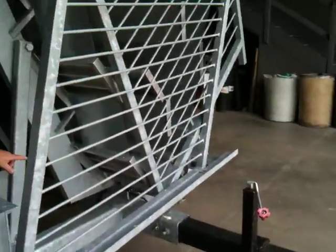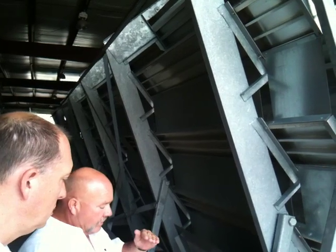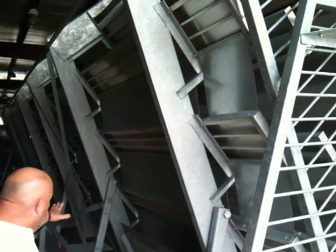And what that is — it hooks right there. See that little black apparatus there? That's a switch. And as long as that cable's pushed in, the switch is open. And the minute that pulls out, that switch closes, sends power from the battery right to the axles, and they lock right up.